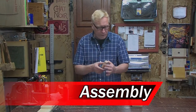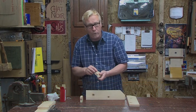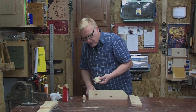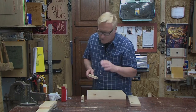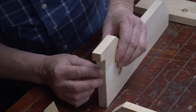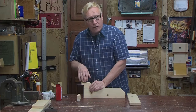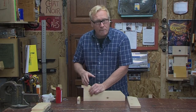We have our horns cut — they look great. I'm going to drill a couple of counter-bore holes with my 3/8 Forstner bit to accommodate the screws and give them enough purchase. I'll throw some glue on the entire surface and use a rub joint — no need to clamp. I just slide this along so it gets a little friction and adheres better, making sure it's flush where the foot is going to meet. Then we throw our screws in.